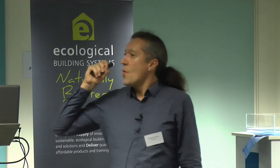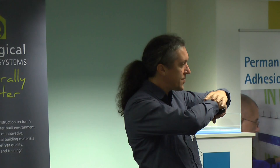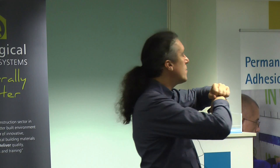When talking about diffusion-open breathable membranes, we must compare two technologies. The conventional technology uses a function layer made of polypropylene that is not diffusion-open by itself. During production, small pores are created in the polypropylene film, and these pores allow the transport of moisture as vapor. If the pores become closed due to dirt or water drops, transport of vapor is no longer possible, because once the pores are covered, the membrane is not diffusion-open anymore.